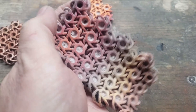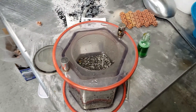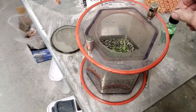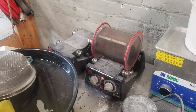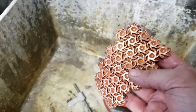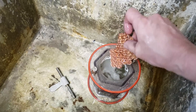We're going to take this piece and we're going to clean it up into a nice shiny 3D printed part. Here I'm adding a few drops of a proprietary chemical buffing compound that we've come up with — you will not get a shiny part without it. The actual time in the tumbler is two hours. I ran it for an hour, pulled it out, changed the water, cleaned it up, reset everything, and did it again. So what you're seeing now is the end of two one-hour runs in the tumbler.